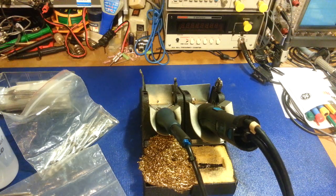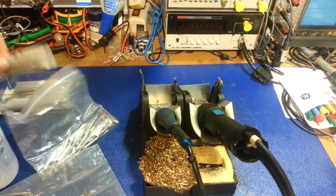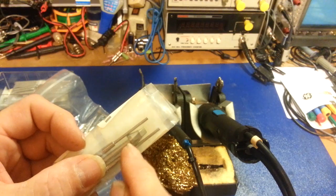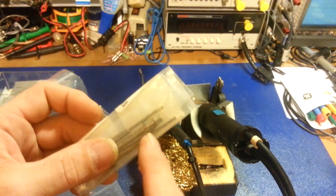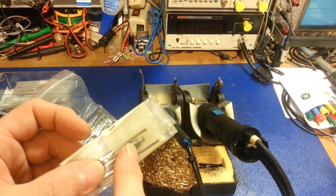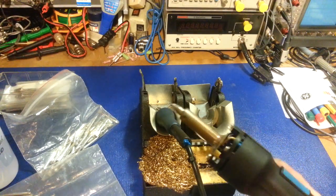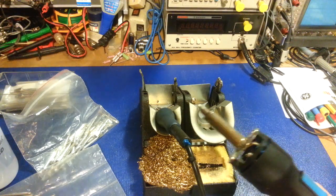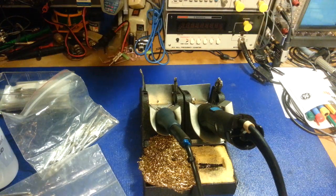Maintenance is the same for desoldering. These tips are no different — you can see through the bag that the desoldering tip is tinned at the end but not at the back, same as the soldering tip. They plate these so solder only sticks at the end. The part at the back is basically a thermal reserve holding heat energy ready for immediate use at the tip. The older style desoldering irons used basically a bored-out copper tube that was tinned — let me pull a drawer full of them out.